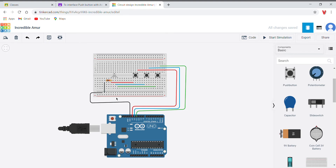Moving on to the positive side, the first terminal — the positive terminal of the RGB light — is connected to one end of the first push button, and I have chosen the wire color red in order to glow red. The third pin of the RGB is connected to the second push button with color blue to glow blue, and the third terminal is connected to the third push button. To complete the circuit, all three push buttons should be connected to the positive terminal on the Arduino board.